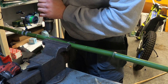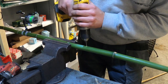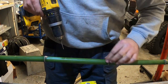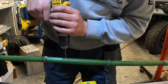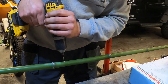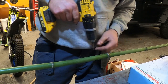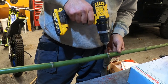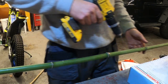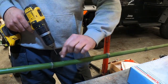Now what I don't want to do is drill right through. That's one. Two — right in the middle of the bamboo. Very easy drilling. That's three — just the pilot hole for the screw eyes to go in. I'll bring you back when I start getting the screw eyes into the rod.